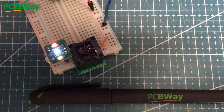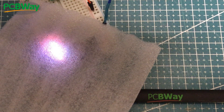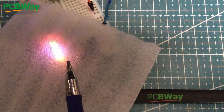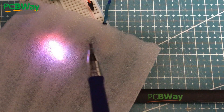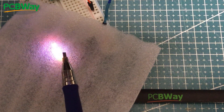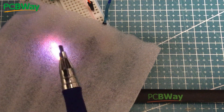One thing is to firstly provide some sort of diffuser over the top — it would look something like this — which diffuses the light and more closely simulates the bottles or jars that I end up putting these things in. The second thing I'd like to do is to swap the leads going to the GPIOs so the different PWM profiles are assessed to see which one is going to work in this scenario with the different colored LEDs.